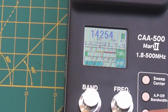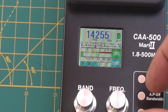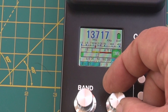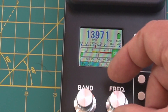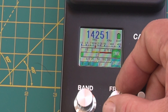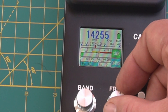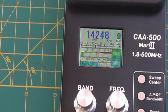Now we'll go graph off. We're at 1.3 now, about 50 ohms. It's 1.2 at one point. At 13.720 it's around 1.1 at 13.9 — so it's still a little bit long. At 14.250 we're at about 1.3 to 1.4, and we're pretty much to the end there. Let's go back to 250. I'm going to shorten this thing just a little bit more and see if we can get it even better — close enough, we're 1.3. I'll be right back.